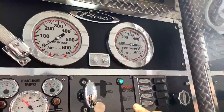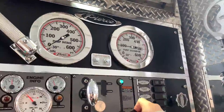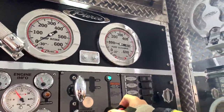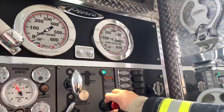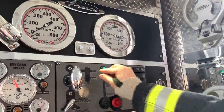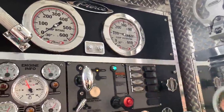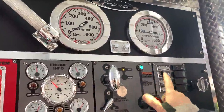When we got up to 120 PSI, the gauge kind of stopped for a minute, and I kept turning the throttle a little. Bring it back up right there — see right there, it doesn't move. So theoretically it should be set at 120, and that's where it's set.